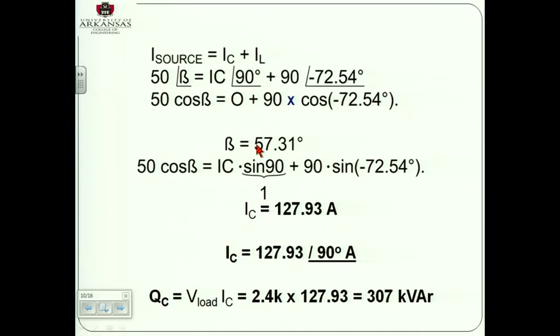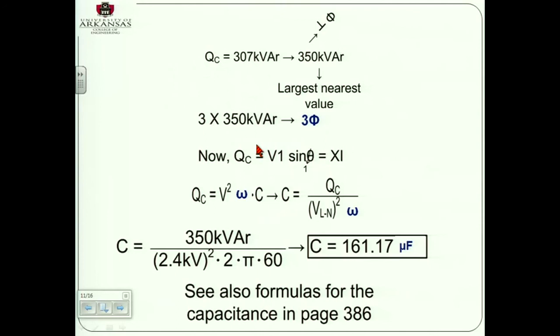So that's basically what you have. You see, the criteria is different now. Now you are using the capacitors to achieve a voltage drop which is under 3%, and what do you hope? That your flicker effect goes away, that it is not noticeable. The problem in the textbook that uses a series capacitor, what happens? It reduces the 1.35. So that's what we have. And here we choose the largest because, remember, we want to guarantee that we get under 3%.